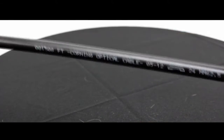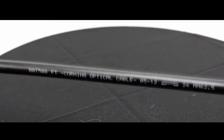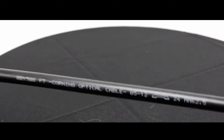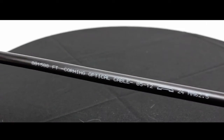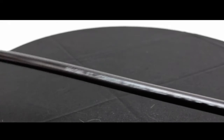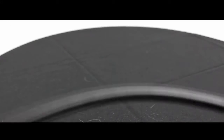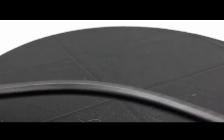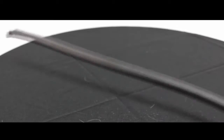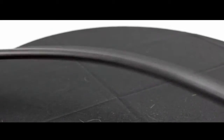This is your outdoor armored fiber optic cable and the jacket is made out of a PE construction. The lifetime expectancy of this type of construction is around 30 years. As you can tell, it's not a very flexible cable at all — you're definitely going to need a pretty large bend radius for this type of cable.